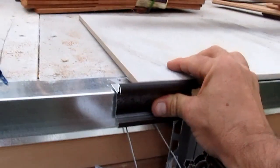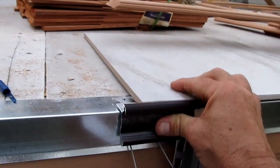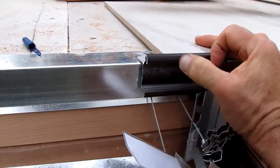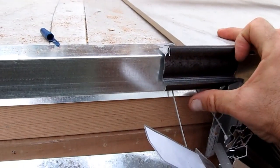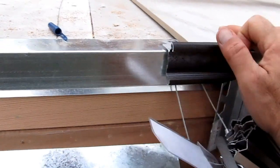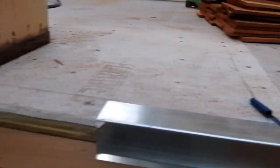When water hits the tile and comes off the bullnose edge, it'll roll down the face, but since it's kicked out by about an inch from the wall, the water will flow into free space and not come down and stain the wall. So this is a nice detail for finishing a tile edge on a deck.